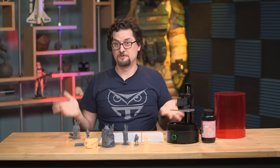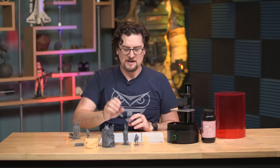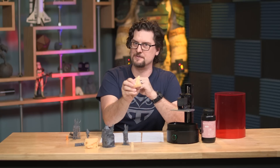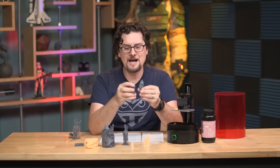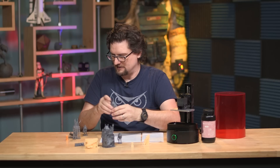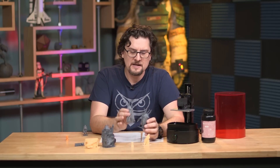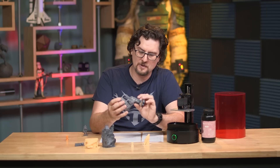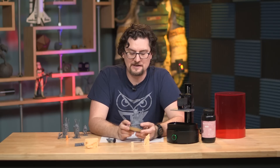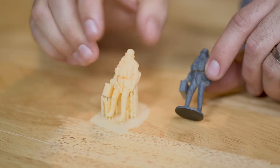Print time is an interesting question — it's not the speediest printer. The little assassin figure took eight and a half hours on the SparkMaker, versus about three and a quarter hours on the Form 2. The scuttlefish took fourteen and a half hours on the SparkMaker and six and a half on the Form 2. The castle ran fifteen and a half hours hollowed out, versus about ten hours on the Form 2. So the SparkMaker is roughly two to two-and-a-half times slower than the Form 2.